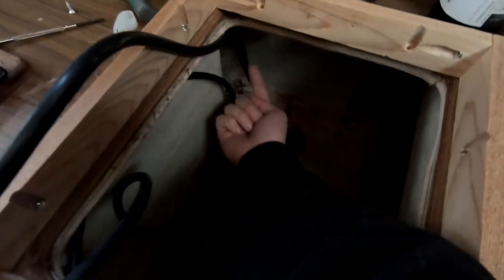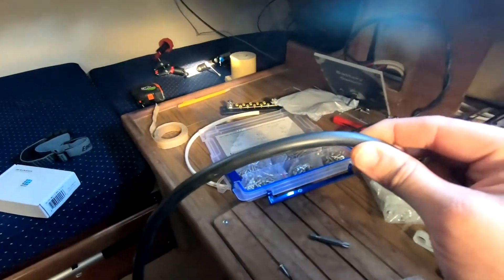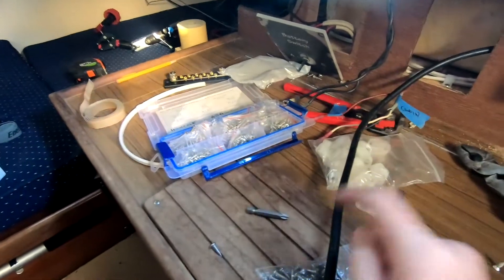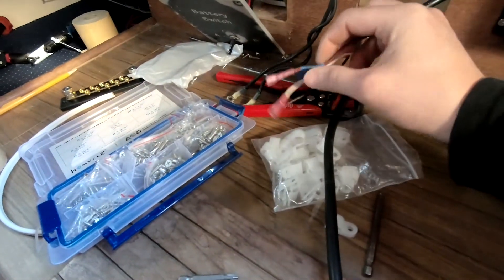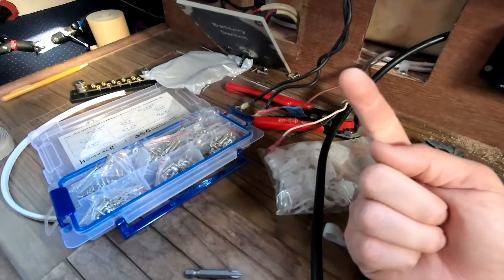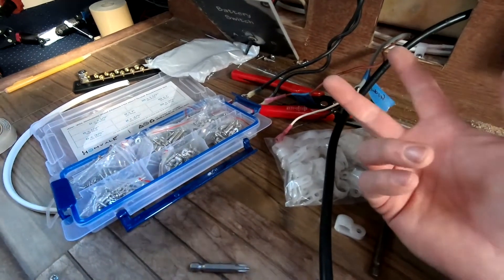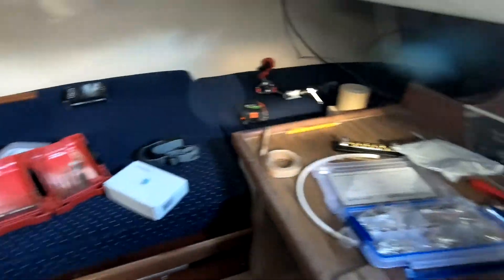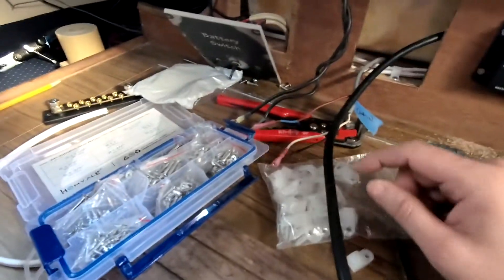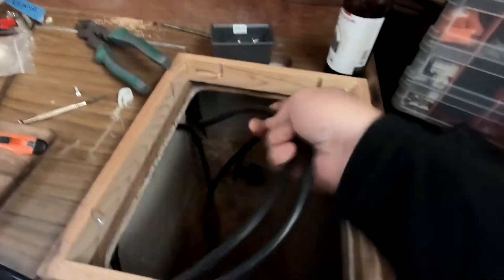I've drilled another hole up under there for it to come out right here. This right here is all the mast wiring. I have to tie it into the running lights, and then there's a separate one — the running lights will actually turn on the masthead fly light. Then I've got a steaming light for motoring at night, and then I have a deck light. So all that's got to be connected to the board, and we still need to get a negative to go into that block somewhere up under. Pulling this through is a good step because now I'm cleaning out all this mess.